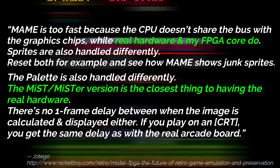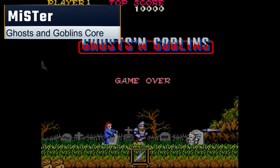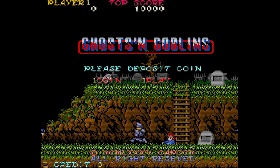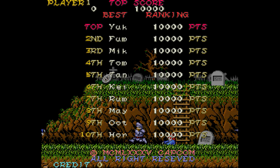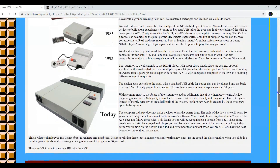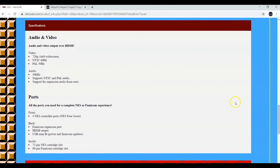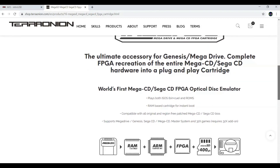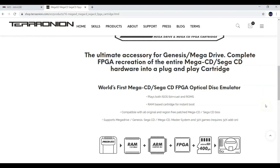Here's the key — the biggest difference. The Pi is doing software emulation, which means it uses audio and video buffering, causing the Pi to have several frames of inherent lag. The MiSTer has the advantage of claiming cycle accuracy, unlike the Pi. Friends who've played both can attest: you can tell the difference. There's definitely a difference in the authentic sound and feel of a game played on FPGA versus software emulation. FPGA is a successful technology, seen in other products like the AVS from RetroUSB or the MegaSD from TerraOnion, which authentically replicate original hardware functionality. Some gamers just want to experience games exactly the way they remembered them, and FPGA can do that.